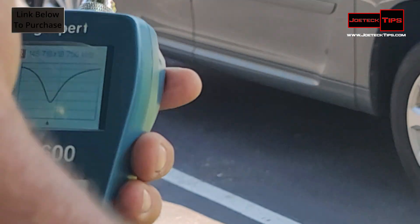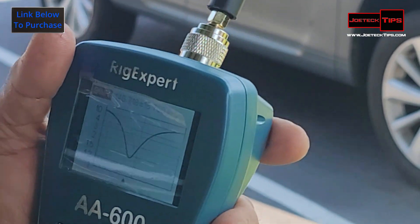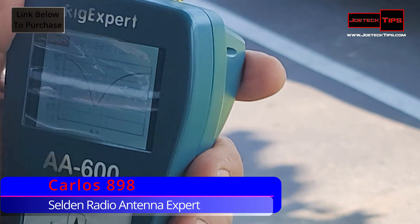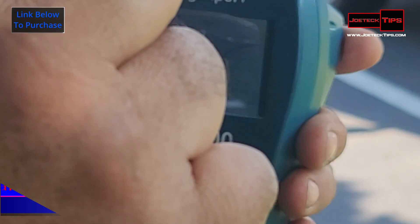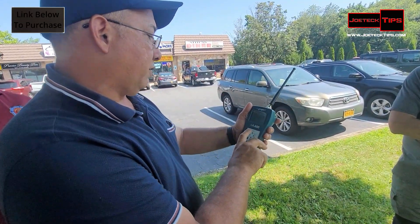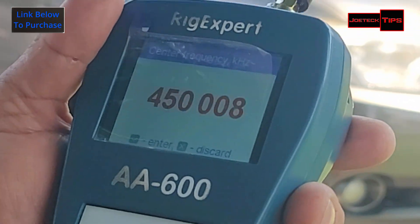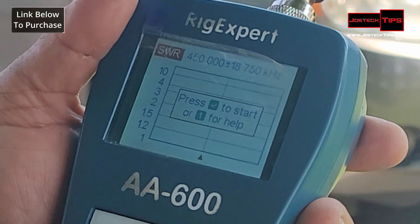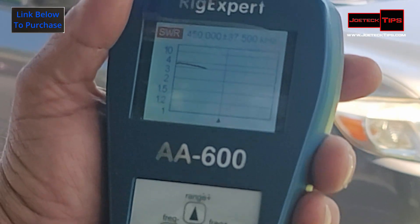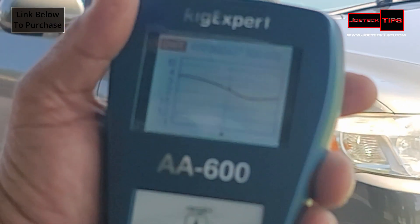Now let's check on UHF. That's where these antennas fail — mainly on UHF. I haven't found a single antenna from a Chinese radio that does really good on... well, I'm lying. I found one antenna. I bought a DMR, a B-Tech radio, and the antenna that came with that radio is good for both VHF and UHF. Let's change frequency to 450 for center frequency. And let's do a span of 37 up and 37 down. This is not really bad — it's below 3, and it goes around 2 on commercial UHF.